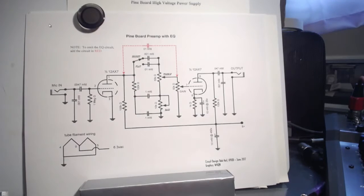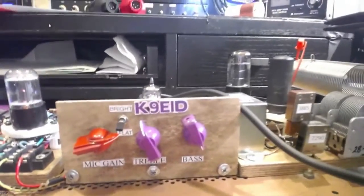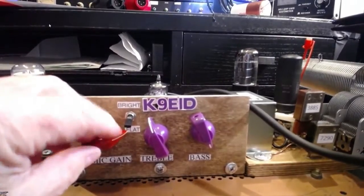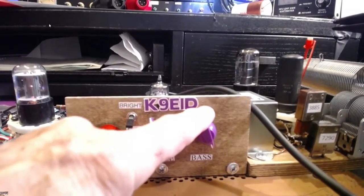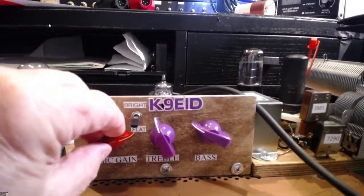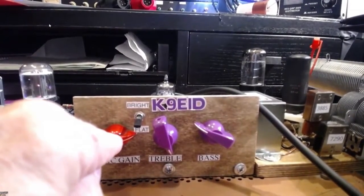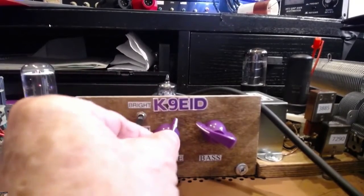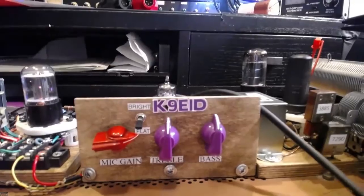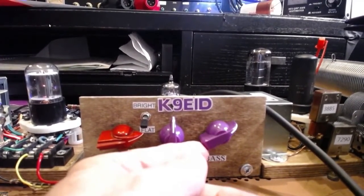But that's just the preamp. Now here comes the good stuff. I'm going to bring on some bass. So if you want to be nice and big and bassy, you can do that. I think what I'll do is show you what I'm doing while I do it. And that's all nice and good. But if you're in a noisy condition, especially on AM, you need to cut through the noise. So I'm going to take out a little bass and increase the treble. Notice how much easier it is to understand what I'm saying. I have not changed the level. Why did it sound louder to you? Because your ears are more sensitive right there in that frequency range.